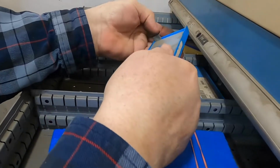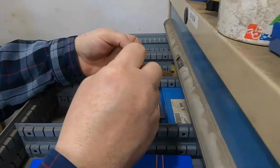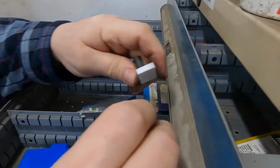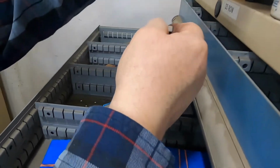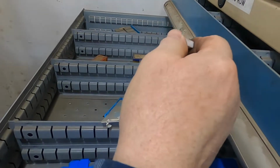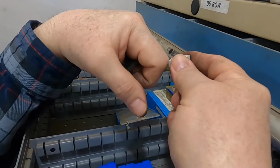The negative in this one here is, again, a ceramic. Okay, we're in the positive drawer. These are all positive. Let's go back here. Okay, back to our negative again. So our negative would be tipped down in our holder so that we can make clearance to our circle. We're cutting a circle. Okay, my thumb is a circle. Just don't cut my thumb. Okay, so we've got clearance there because it's tipped down.